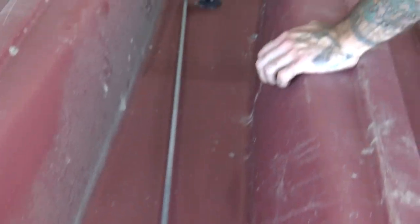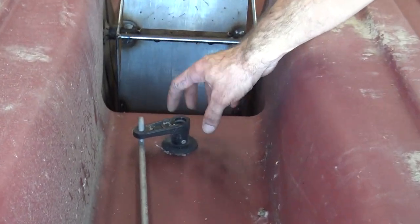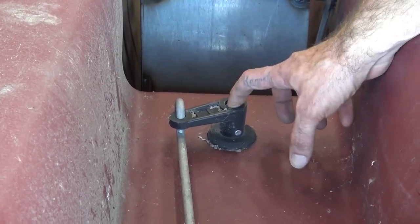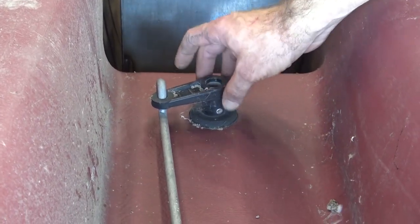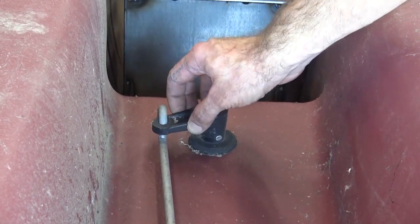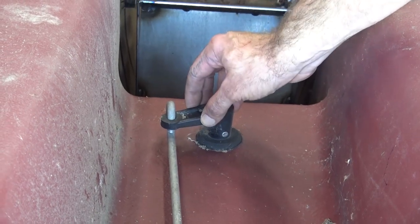The same might happen up here. And it's not that hard to fix. Typically you're gonna have a steel arm coming through the center shaft, so you can weld to that. So it's not that hard to just weld an arm off of that shaft over to this. This would actually be the easier fix when talking about problems that you might have with your steering.